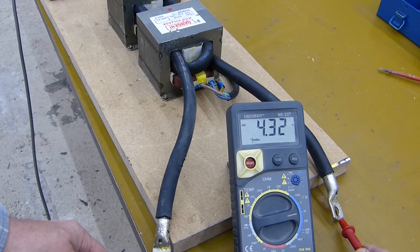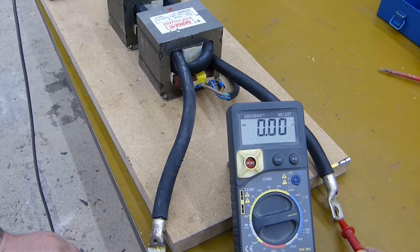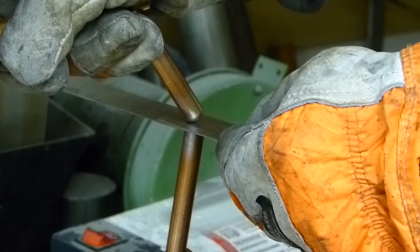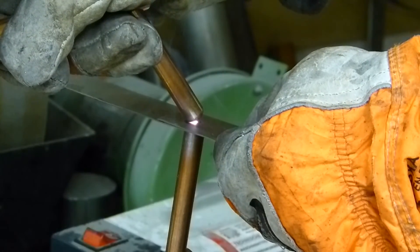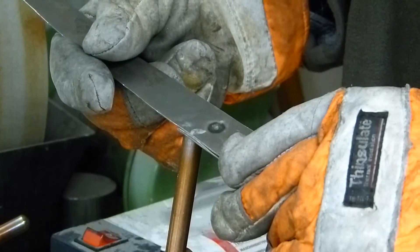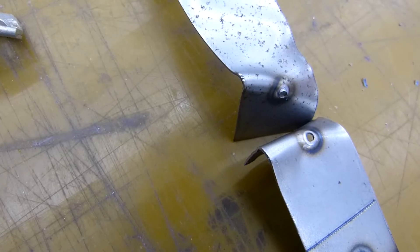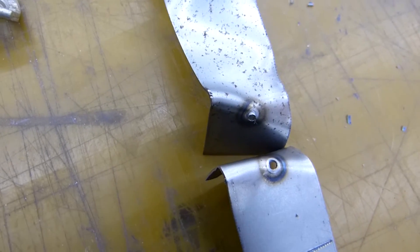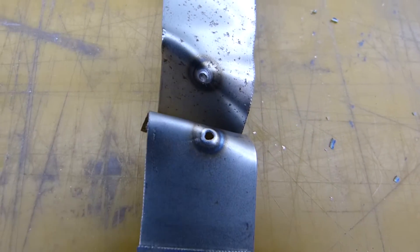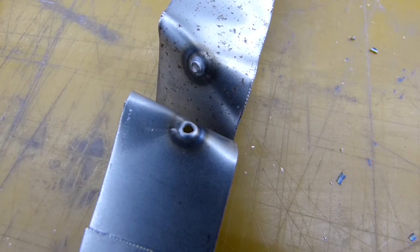That's the first measurement of the voltage — it turns out to be 4.3V on the secondary with 220V on the primary. It's a little high at 4.3V but should be good enough for welding. The first test is looking pretty good — it was roughly one and a half to two seconds weld time on two sheet metals of 0.8 millimeters. On the pull-out test you can see it was not the weld which broke — it was the surrounding material — so the weld itself was perfect.